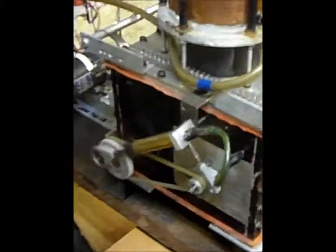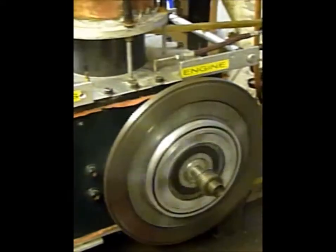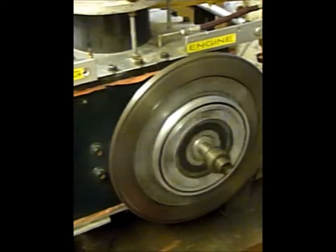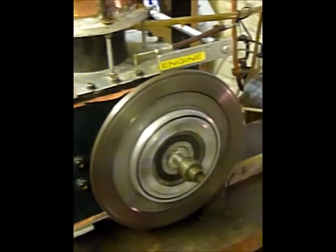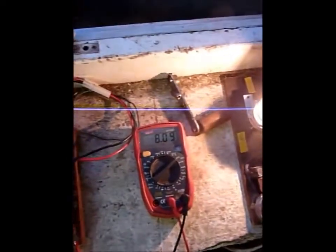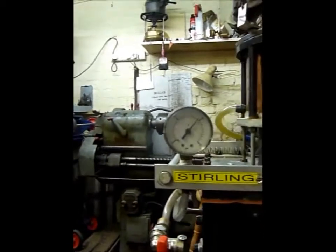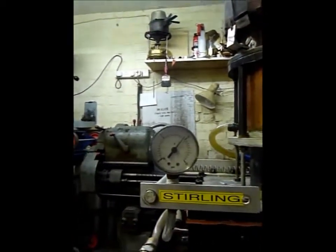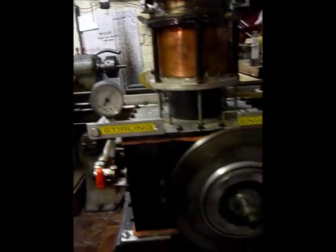Here's the gas pressurisation pump. With more molecules in the engine there's more energy to drive it. So there it is — pressurised to 10 psi, making 8 volts, and driving an air pump, a cooling fan, a water pump, and a 75-watt bulb — all from a smaller diameter engine, 4 inches rather than 5 inches, and a lot shorter. The interior fins make all this possible. They support a far greater heat transfer and can heat the greater pressurised volume of air.